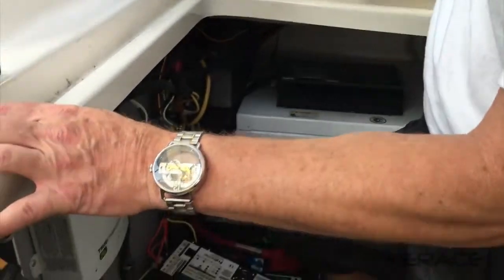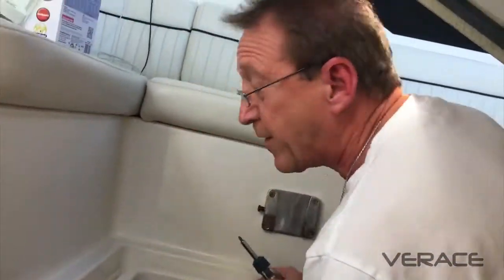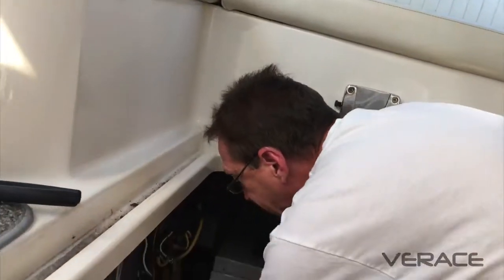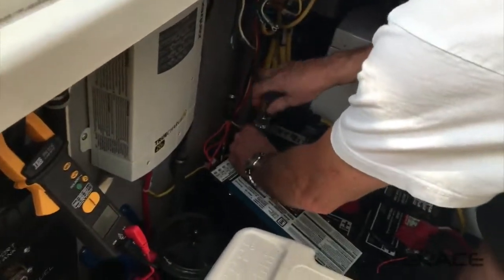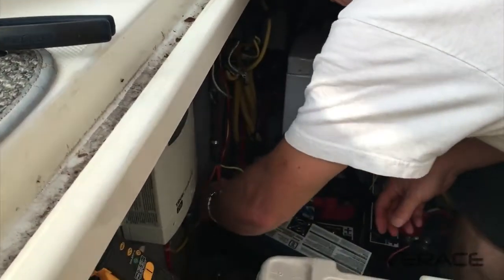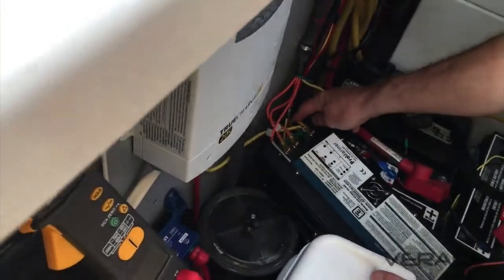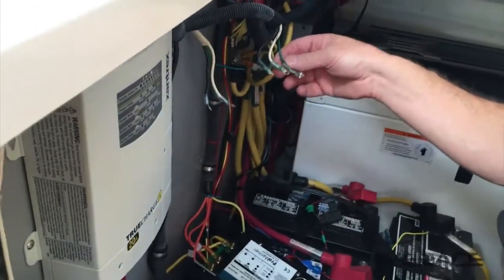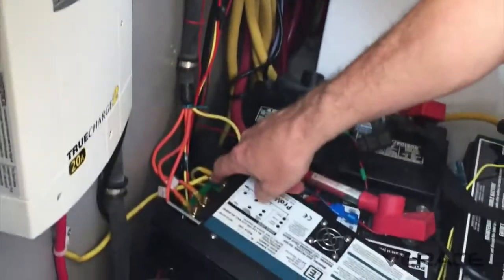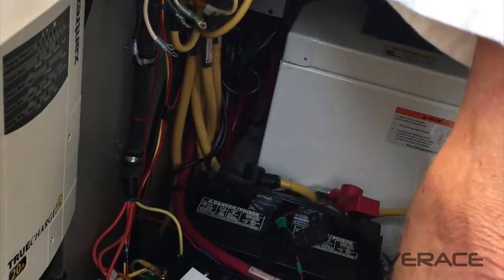We're going to turn off the DC main — there's no AC coming into the boat. Shutting off the DC doesn't fully disconnect from the batteries; it takes them offline but they're still live. If I start shorting anything out here I'm going to be in big trouble, so stay away from crossing wires or creating a short. Now we've got four wires exposed: yellow is your DC ground — quite different from your AC ground — and that's your AC ground coming from the marina. And that's your DC ground, or negative.